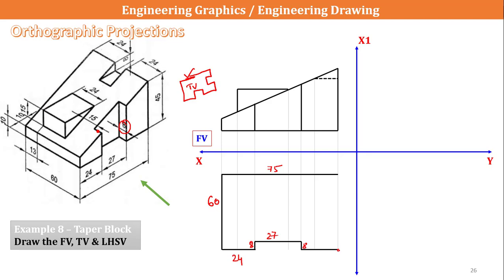This line will be around 27mm, and again on the downside it will be 8mm. I will join to the corner of this particular length, which will again be 24mm. I need to draw one more joint line up to 24mm length. Since there is a missing dimension, I am taking a construction line. Since the total is 60mm, 60 minus 48 gives me this particular length, and then I touch the line on this side to make the connection, giving 24mm again.